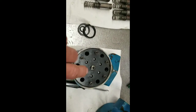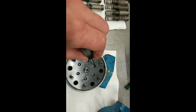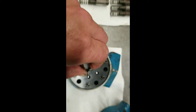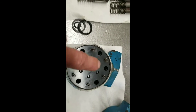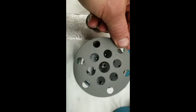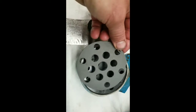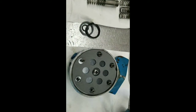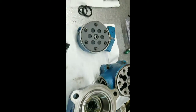Put the plate on, put the screw in there. The Ford guy said to make sure all the check valves are seating on the plate because now's the time if they're screwed up. The bolt retained that, so if you split the back cover off there's no chance of losing those balls. What you will have to do is get this gasket off. Watch this o-ring here, but there's balls that go in these seats. These are piston holes here, these are the seats. So the rest of these balls are going there. The shaft will go in the housing that way.